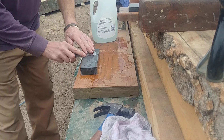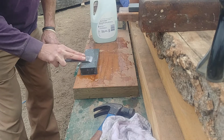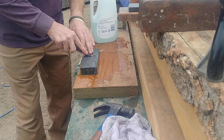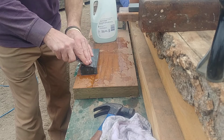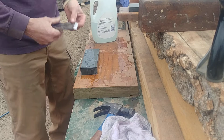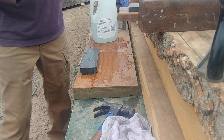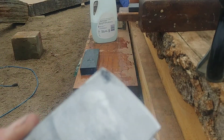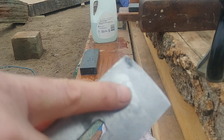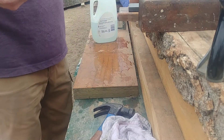Burr's all the way across. I'm going to take it off — I don't need to do any more than take it off. I'm going to raise up a little bit, polish the back. It's gone. On these cambered irons I can make some swooshing motions just to even out that curve. I'm chasing the burr around a little bit. Taking that off — raising up just a little bit. You can see just the finest edge across there. This one's done.